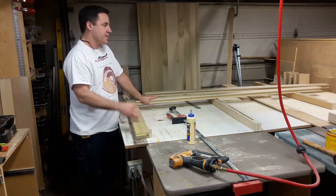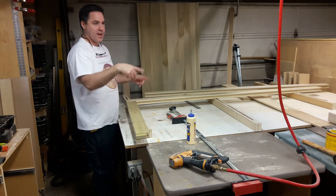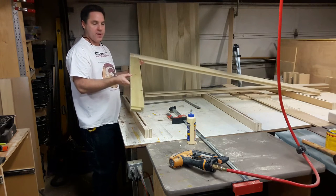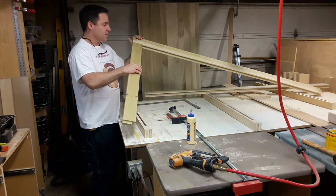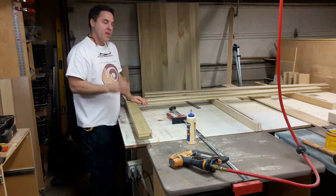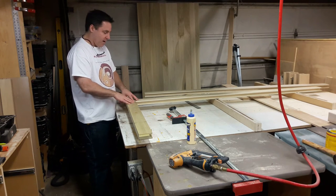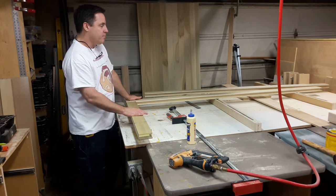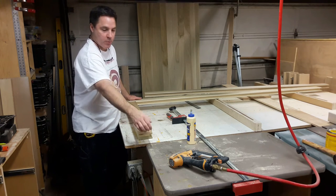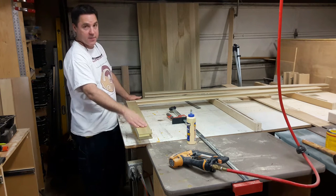Since I've got two doors, that's going to mean I'm going to have four stiles and four rails — two on each door. What I'm going to do is build these into four sub-assemblies in the shape of a letter L. I'm doing this for two reasons: one is I can actually sand and finish these things as I go. But you don't want to finish the whole thing because you'll end up sanding these joints where the other two meet, and if you put stain on it, it's going to look like garbage. You can sand and polyurethane the edges if you want — that's totally fine.